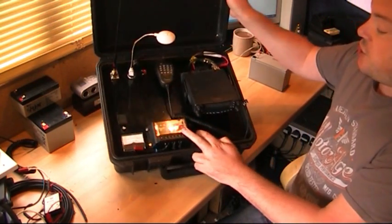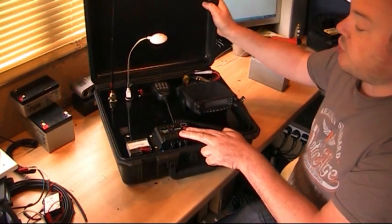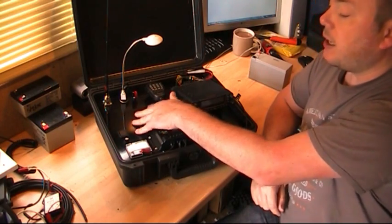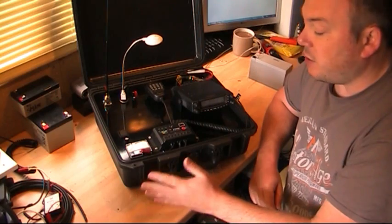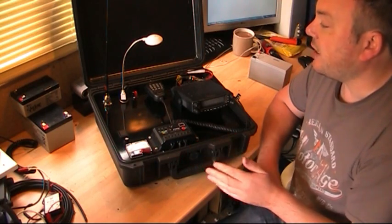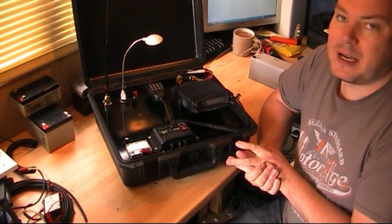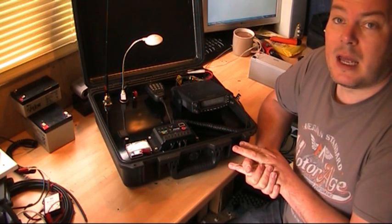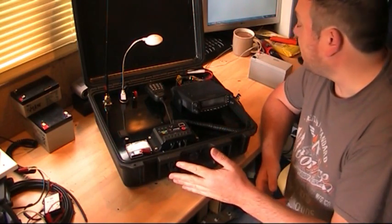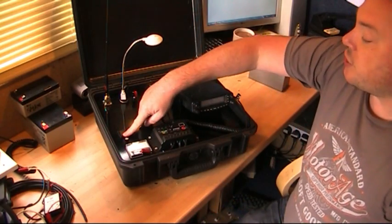This is the latest addition: a solar charger controller. What this enables me to do is charge up the lead-acid battery that's underneath the case lid and keep the battery protected against total discharge and overcharging. One of the problems I had was discharging the lead-acid batteries too often — if you go below around 9 or 10 volts you can actually ruin them.